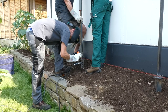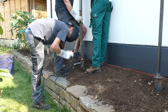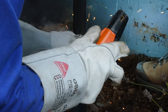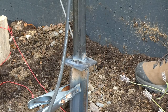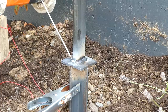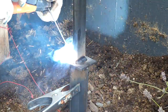In the next step we set down the poles and used two bubble levels to make them sit as plumb as possible. Then I tacked them and welded them to the anchor. This might seem strange — you could weld the pole to the anchor first and then punch them into the ground. That would ensure perfect alignment, but it makes punching and aligning the poles much harder. So we did it this way and it worked out just fine.